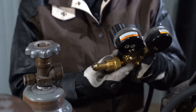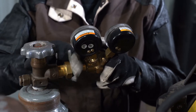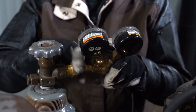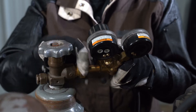On the regulator you're going to have this nut here — make sure this is slid forward — and you're going to insert it into the valve and slowly hand tighten it. Make sure you're not cross-threading it. If it feels real tight with a lot of resistance, you're going to want to stop, back it out, and re-thread it in so it goes in smoothly.